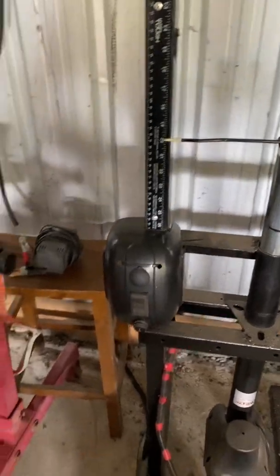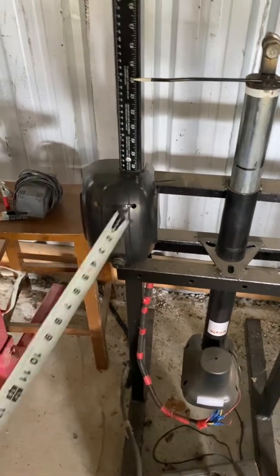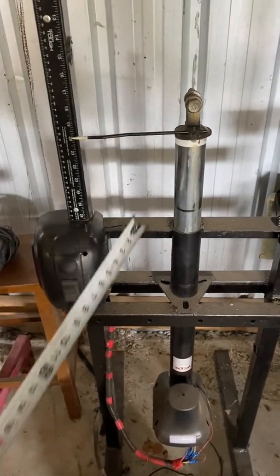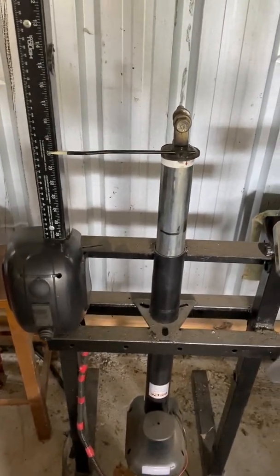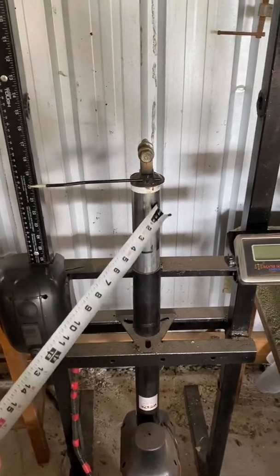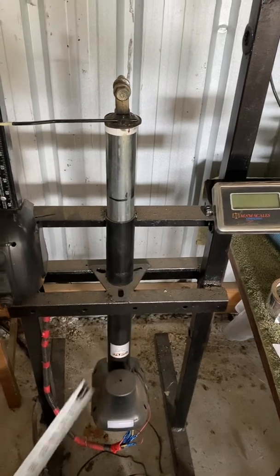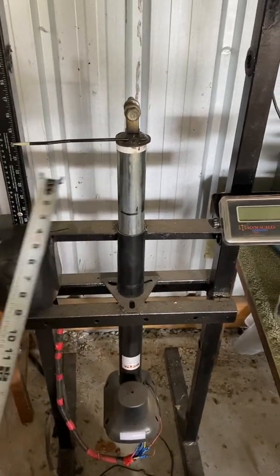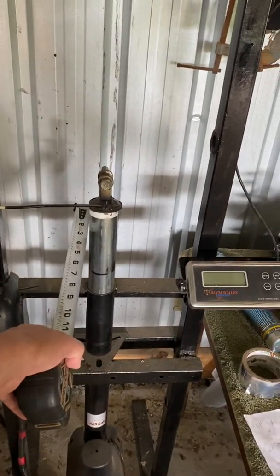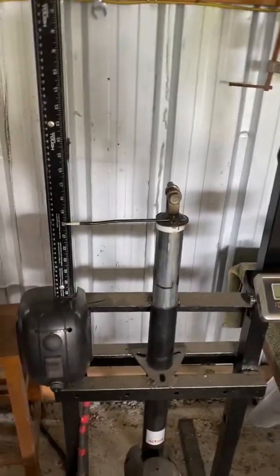You start smashing your springs. I just took this off the jack and mounted it here, and put this little support on here. I didn't use the support at first, but once you get up around 2,000 pounds or more, you start putting a lot of pressure on this and it bent the mount over a little bit, so I welded this little support in here. It would actually be nicer if you made something to support this piece all the way up and down, but I haven't had any problems since then.